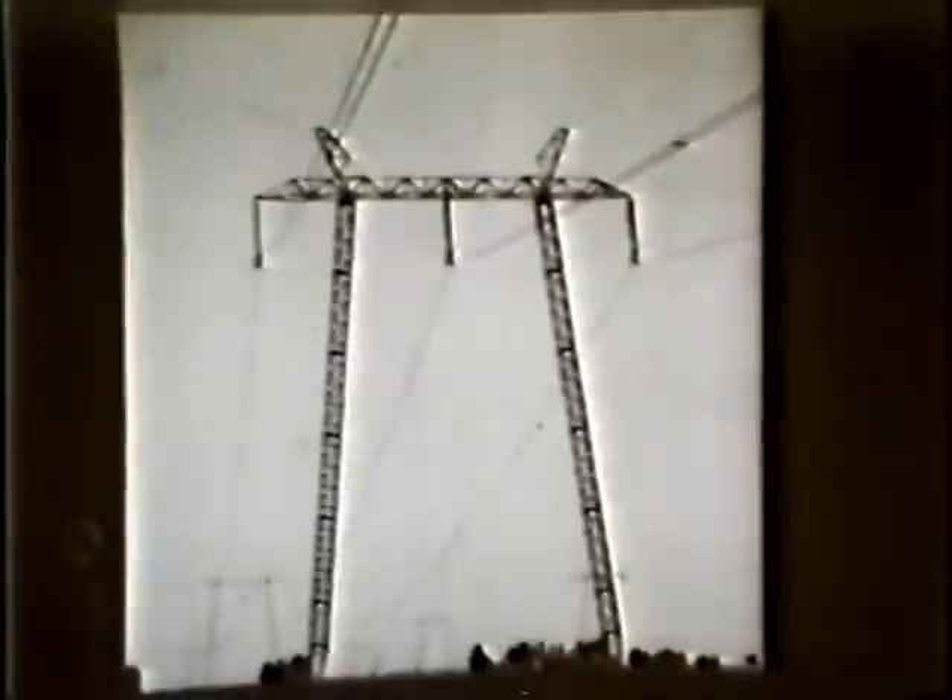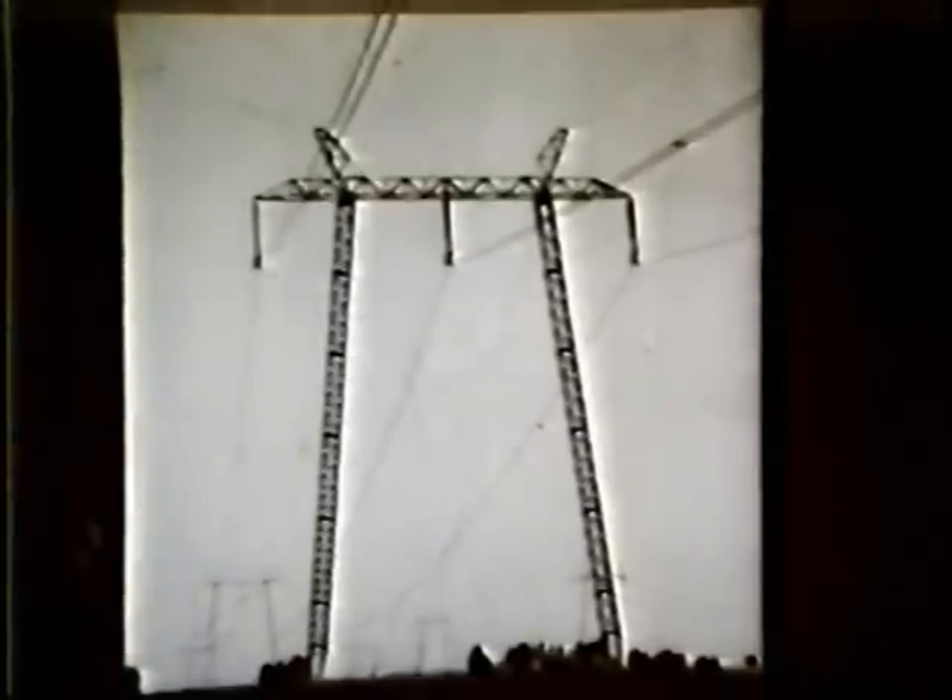It was made at about 100,000 volts, transmitting megawatt power to Buffalo, 20 miles away. This is a modern way of doing it — because the voltage is very high, you want to make sure there is no sparking against the ground, so you have to put the lines very high up. The higher the voltage, the higher the cables. And of course you have three-phase cables carrying the power over long distances.